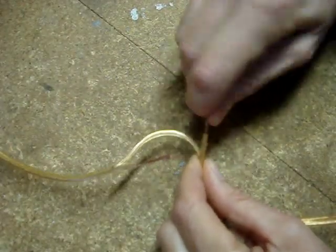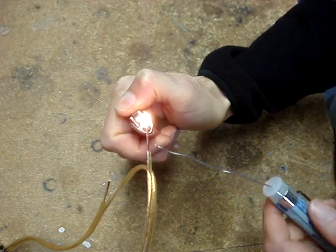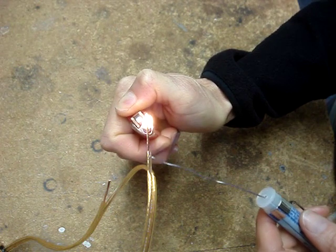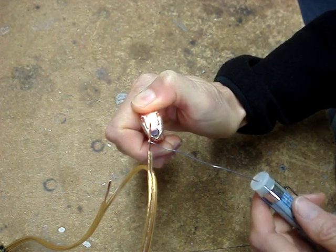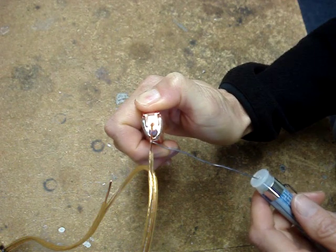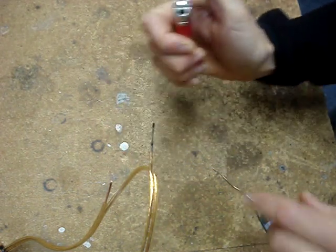Best practice is to tin the ends of the wire. If you don't tin the end of the wire, it'll spread out under the terminal. It's likely that you don't have a soldering iron — you can tin the ends of the wires with a lighter and some 60-40 rosin core solder. While waiting for the solder to melt, always remember to break the hot wire when installing a switch. If the plug on the cord is non-polarized, I'd recommend installing a polarized plug, as a non-polarized plug can cause the neutral wire to be switched — a potentially dangerous situation.